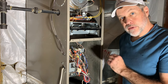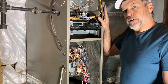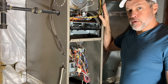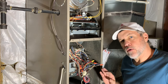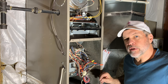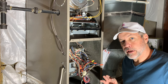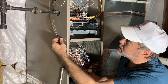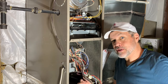The first step is to make sure you secure power to the furnace you're working on. This is the circuit panel that we need to get access to. On this particular model furnace I had to remove the upper cover to get the lower cover off, but it's not really necessary to access this portion of your furnace if you don't have to. Now we're inside the furnace or air handler — it may look a little overwhelming at first but it's really pretty simple. There are just a few wires — four — that we're going to be looking for.